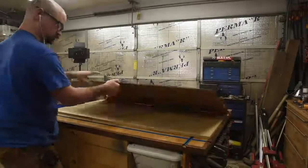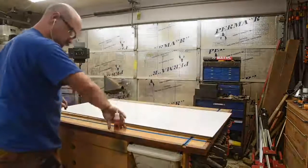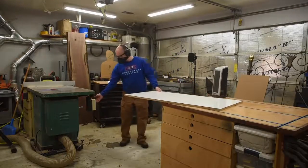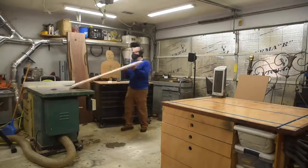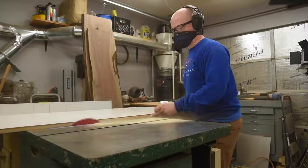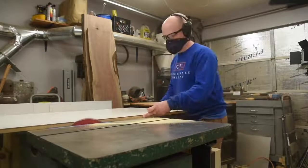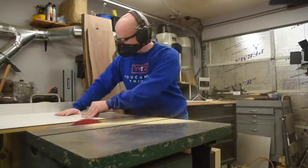While I was in Home Depot evaluating my choices, I did some phone research and discovered these marker boards are actually melamine, which epoxy doesn't stick to, and bonus, it doesn't have all the bumps of the particle board melamine you normally see. But it's really flimsy, so I just used some Starbond CA glue to attach it to a sheet of MDF and then trim the edges.